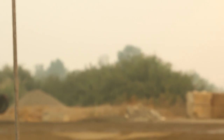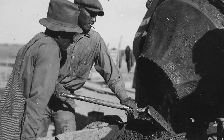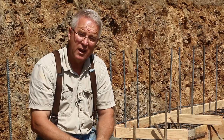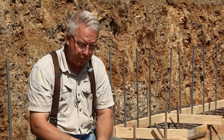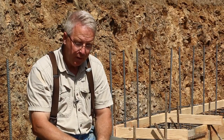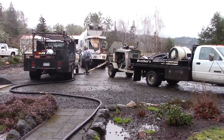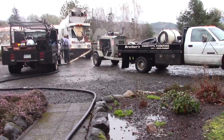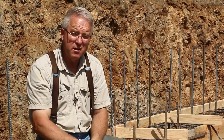Or perhaps you have to put it in a wheelbarrow and wheel it back around the corner — don't do that if you can help it. The method of choice around here is using a pump, a line pump. It's the method of choice because you get exactly the amount of concrete exactly where you need it. You don't break anything driving the truck in, the truck never gets stuck, you don't have to jump him over — there's just a whole bunch of reasons. Let the dispatcher know if you're pumping out of the truck.